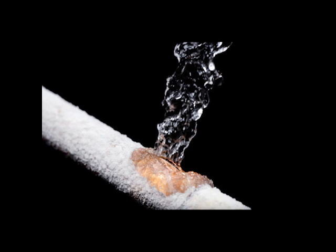Additionally, hoses must be removed after each use to ensure that the frost-free technology isn't compromised. Hoses left on run the risk of bursting your pipes because of freezing water.